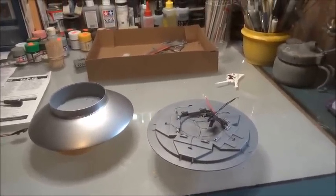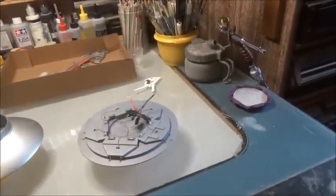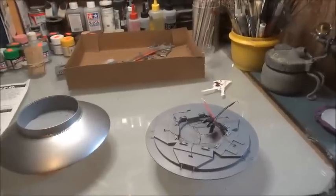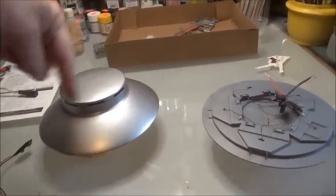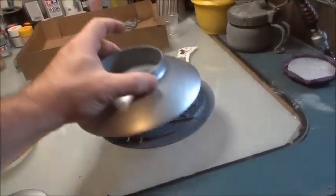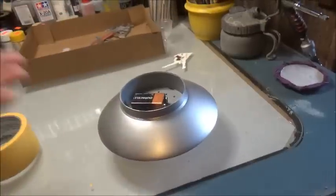So now I'm going to risk tearing into it today because I've got the lighting done for the, you saw this yesterday, I got the lighting done for the blue engine lights or landing lights or googly lights, whatever the aliens call those. And today I am going to be working on the chase lighting that goes inside the top. I have cut out all of these slots, and there's lights that give you the effect of that. Also, at the same time, and of course this goes on top of there, all at the same time I need to make a battery compartment. This model will have no interior. It'll have a battery compartment, a switch, and this circuit.